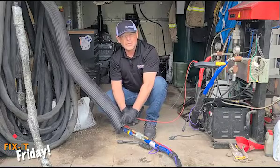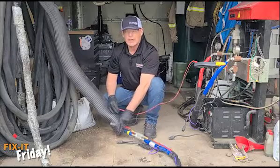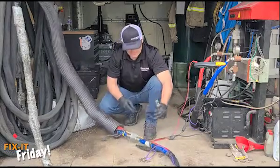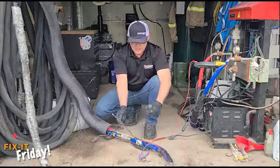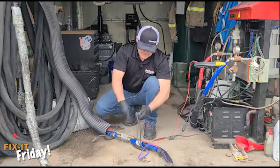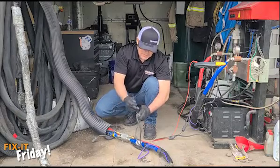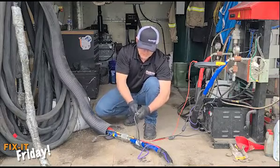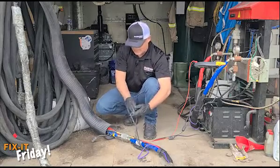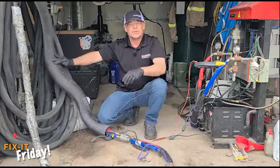Now that doesn't mean that we're done. What we can do is bypass that part of the heating simply by taking the two final lines coming out of the last section of hose and looping them together. We can attach these, then go back to our machine and test for continuity to make sure that there isn't more than one break in the system.